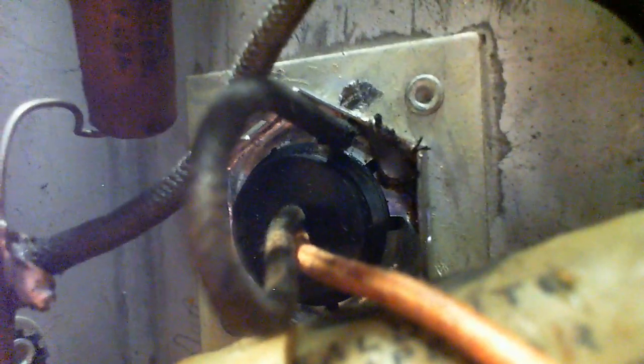So how do they handle that black wire coming out of that capacitor? Looks like there's a solder terminal. Awkward to get at down in there. Square plate riveted onto the radio. There's another plate, but this one, see, this one's insulated. That dark material is insulated, so this capacitor, the outside shell of it is almost certainly not at chassis potential. Gotta watch out for these things.